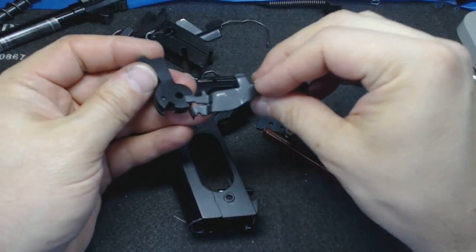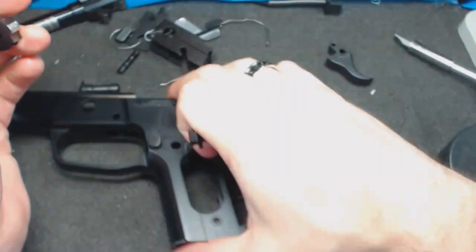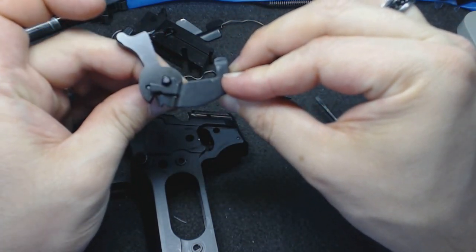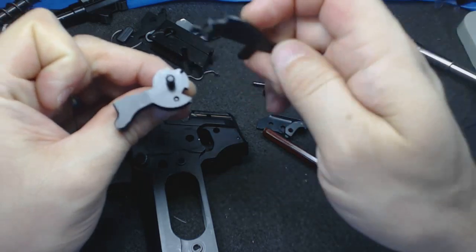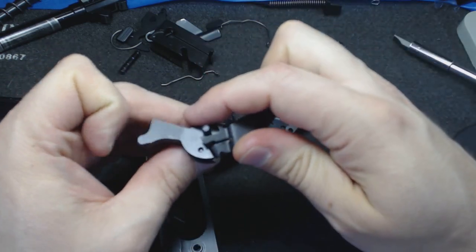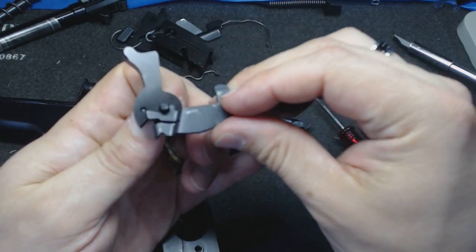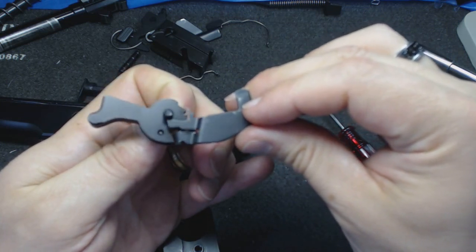So when the gun's not cocked, the trigger bar will be sitting all the way back here. And if you recall, we noted before that the hammer pin stuck further out one side because the trigger bar sat right under it. So what you're going to see is, as I'm pulling the trigger bar forward, it's going to cock the hammer back, but it's also getting pushed down. And at some point, if my hands were steady enough, you would see that it gets pushed all the way off the bottom of the hammer, and it's no longer holding on to that. The problem of illustrating it is that I don't have perfectly steady hands, but the idea is that at some point in that hammer pull, it will clear that ledge.